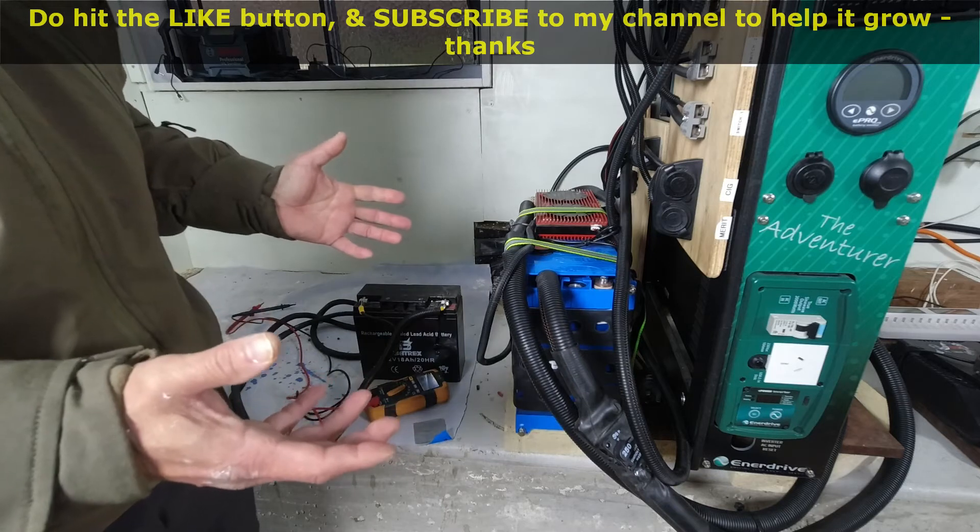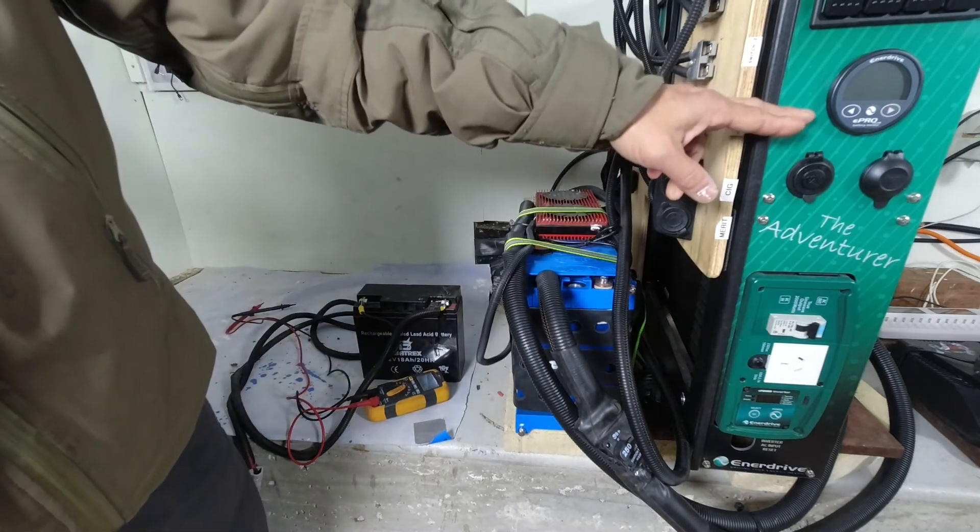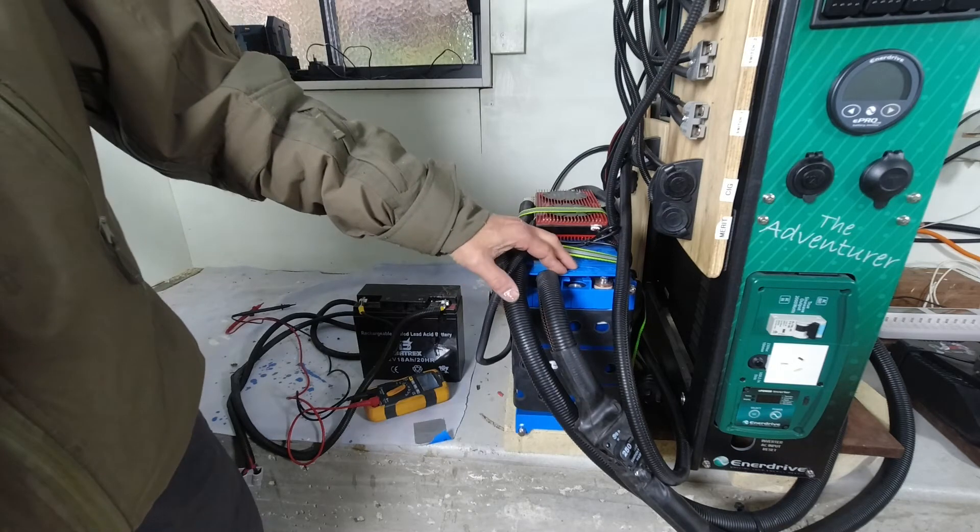I'll try and understand what has happened. When I began the last series of charging the Bosch and Milwaukee batteries, the ePro battery monitor showed the battery was at 30% state of charge. I suspect that as the inverter continued to supply power to my battery chargers, the voltage eventually dropped below 10.4 volts — the shutdown voltage of the battery management system — disconnecting the inverter. After several hours, the battery voltage must have slowly climbed back upwards. However, the battery management system must have some operating protection that prevents it from waking up until it detects an external voltage at least 0.8 to 0.9 volts higher than the existing battery voltage.